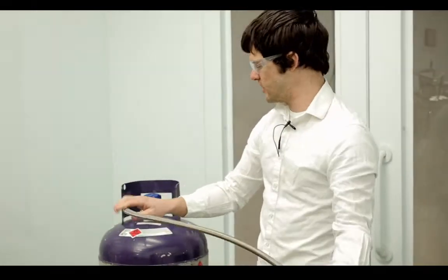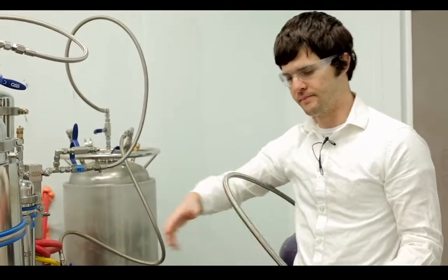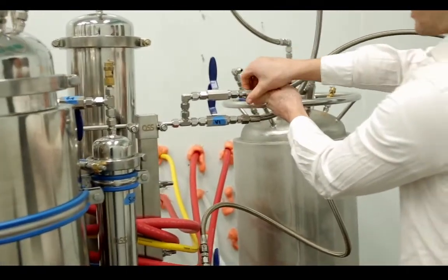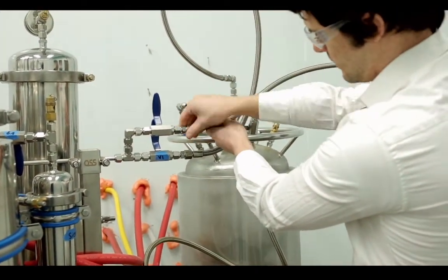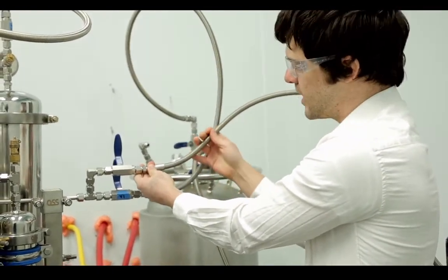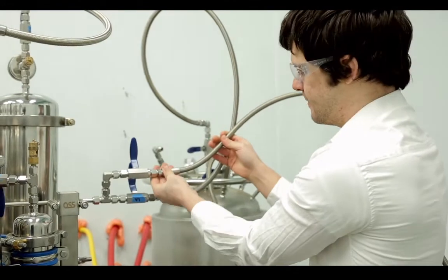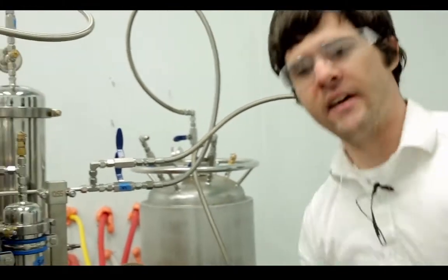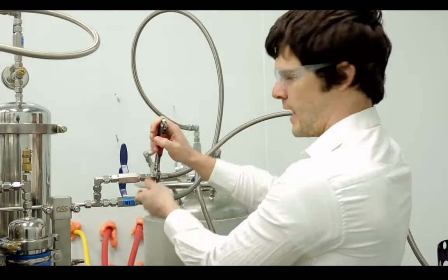From our solvent vessel, we have an accessory port here that's leading into the injection rail of our machine. We will connect this end of our solvent hose to our accessory port, hand tighten. Sometimes this gives you a little bit of resistance. The way that you can remove that resistance is to jiggle your hose a little bit as you're hand tightening it. It kind of makes life a little bit easier. Never over tightening anything, finger tight, and then a quarter of a turn.